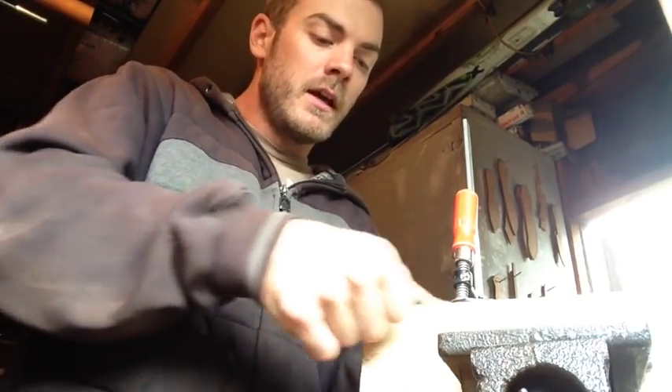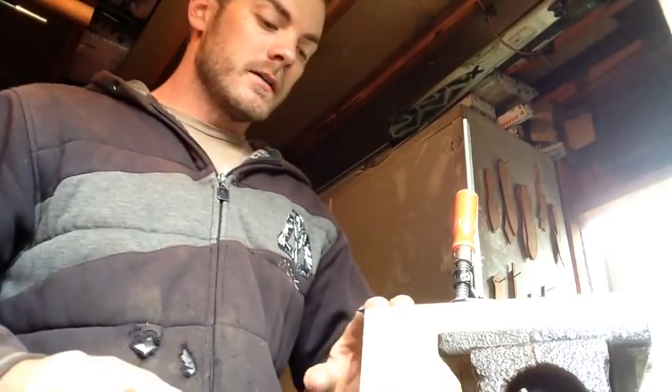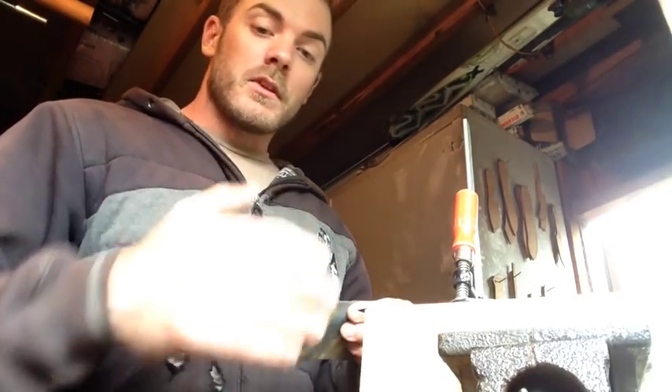I cleaned them up — the 4x36 goes up to 120 grit on a belt — and then by hand I go 220, then 320. I'm stopping at 320 for these knives because they're a utility knife I'm hoping gets used almost every day, so I'm not going to polish up to 1200 or 2000 grit. The 320 is a really nice, clean satin finish, and I'm hoping these things get a little beat up anyway.